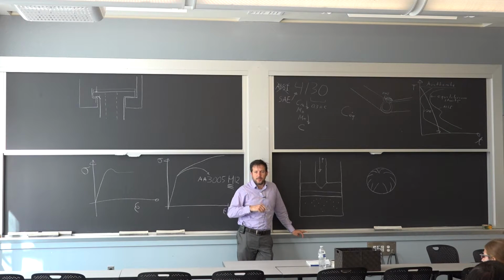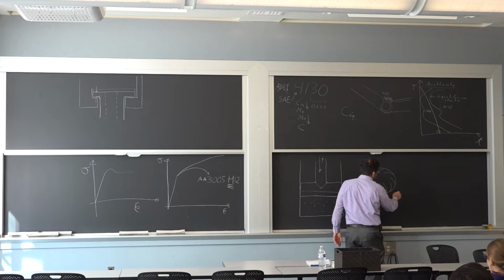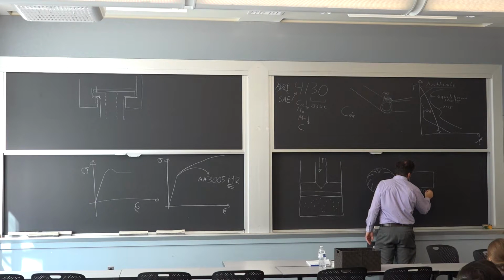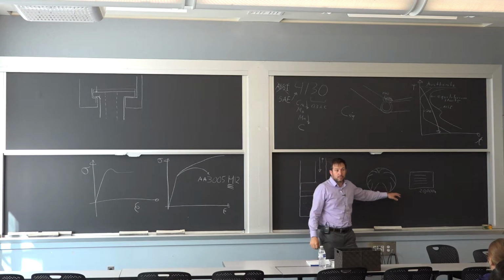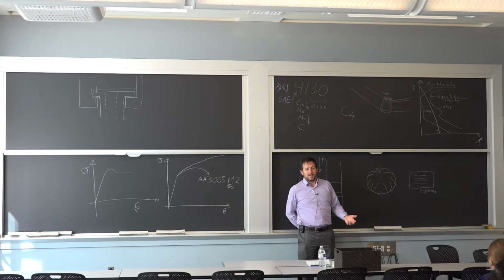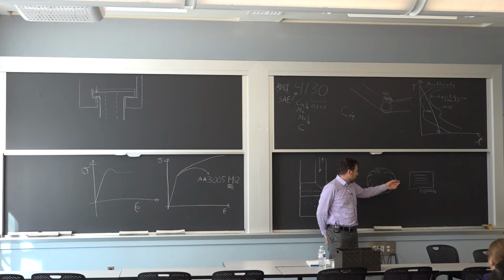We did a detailed failure analysis at a very, very fine scale in this zone here. So say I take this zone and I'm under the electron microscope, we had to go approximately 20,000 times magnification. What you can see is these very, very fine lines for each time that the punch went through, the crack grew by a certain amount. And those are the fatigue striations. You don't always see them. It's very nice to see them, a little bit like when we were talking about looking at dimples on the fracture surface. You see dimples, you know it was an overload fracture. So you see those very fine striations, you know it was fatigue. Now, you can have fatigue that will not leave those lines behind. That's very common. So it was very difficult to find them in this situation.